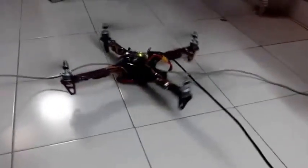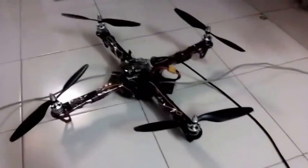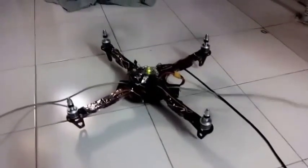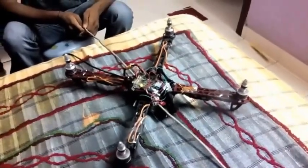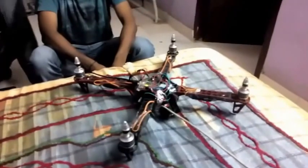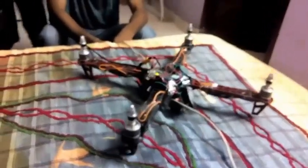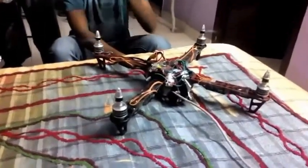Here we are going to show the quadcopter system. We are going to identify the quadcopter error without causing errors in the IMU and the BeagleBone. So it won't take off. We are giving it some delay — after the delay it starts again. Here we are passing an erroneous IMU value using the gyroscope for testing purposes, and again giving some delay, during which it stops rotating. Again we pass the correct value, and here it starts to initialize to take off, but due to the increasing motor speed it does not take off completely.